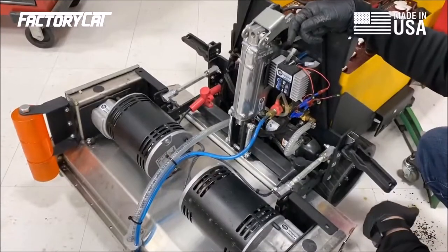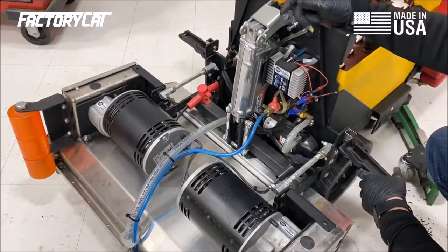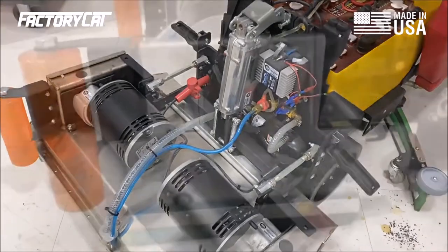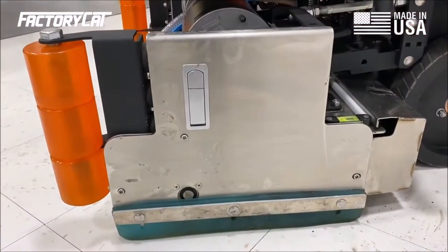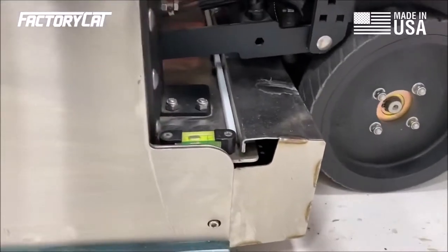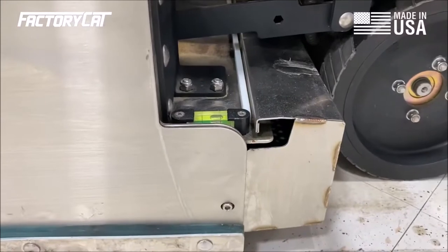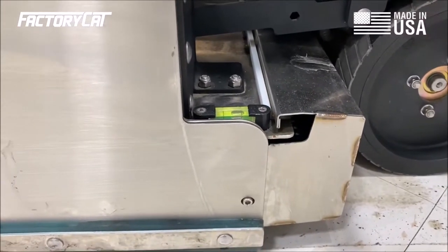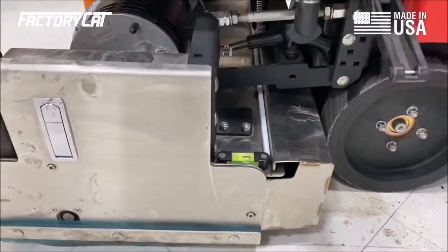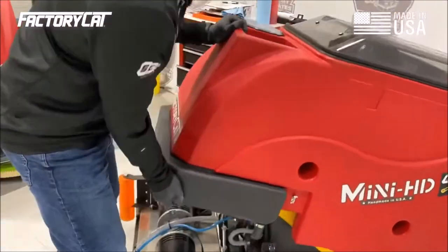Okay. Then we check the deck for level. So the deck is checked for level by lowering the deck and then operating the machine and watching the bubble. If the deck is level, we proceed to the next section. If it is not level, we're going to adjust that level